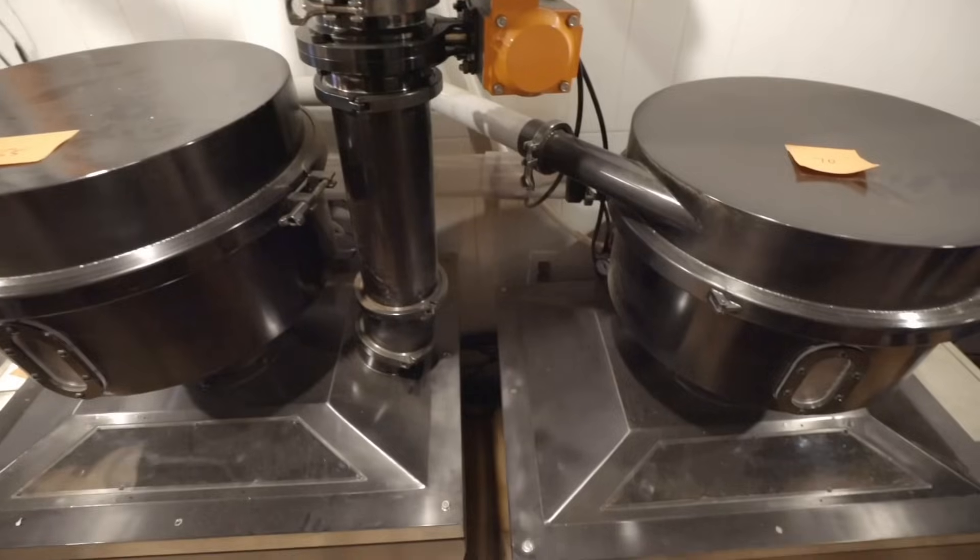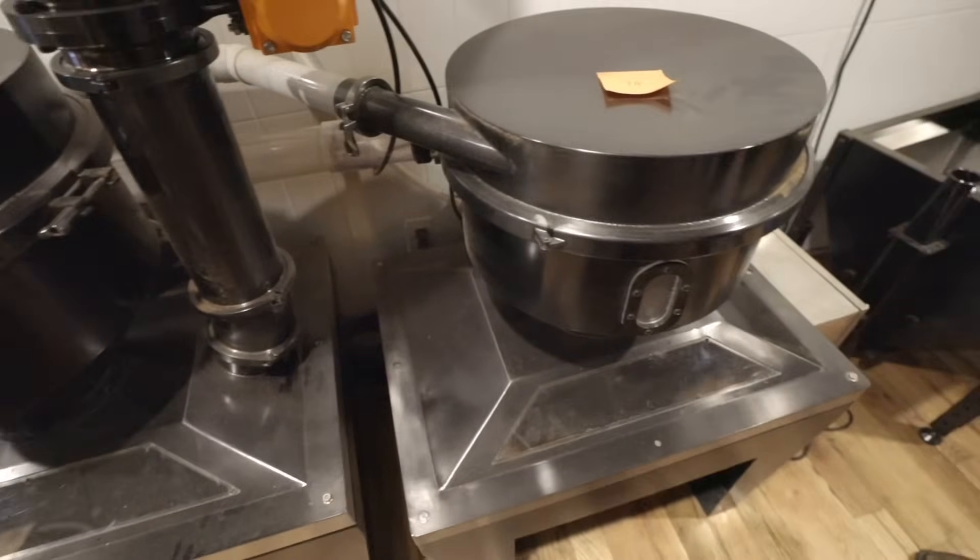The conveyance system is a vacuum-driven system, so we've got a beautiful vacuum manifold on the exterior of the building to keep noise reduced. That will actually pull the coffee through the tube into a specific cyclone system that drops the coffee into a pass-through hopper, which penetrates through the floor and places the coffee relatively gently on top of the Pearl's vibrator plate so it can be fed into the optical sorter.